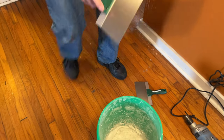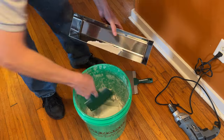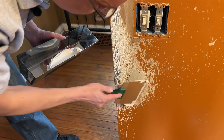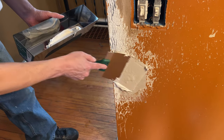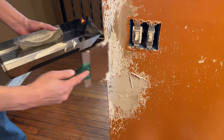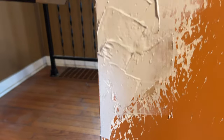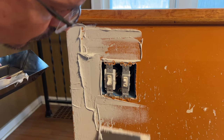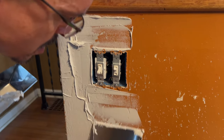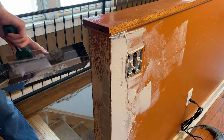I'm going to start with a six-inch knife. Let's start by filling that indentation right there — that was the low spot. We'll get some extra mud in there first.